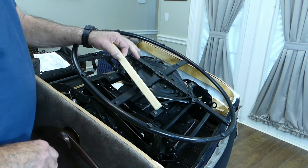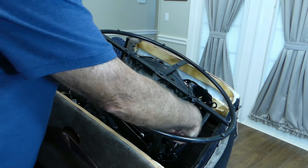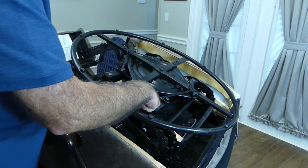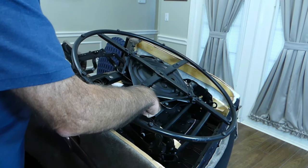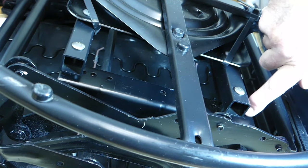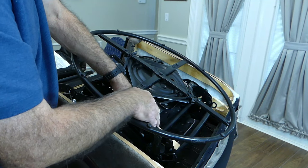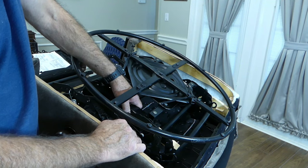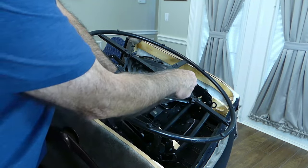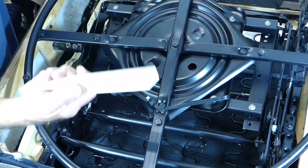To do the repair I'm just going to use a piece of 1x2. I'm going to slip it up under this angle bracket right here and butt it up against the stationary piece. Now as I open the recliner and close it, you'll notice that stays in position — it doesn't move. There's a series of holes right here. We're going to drill through those and attach the 1x2 to the recliner with some bolts, then drill a hole here and attach this piece to this. When you open and close the recliner, this stays in place and we can lock the rocker mechanism. For additional strength, you'll probably want to put one in on each side — the other side is identical to this one.